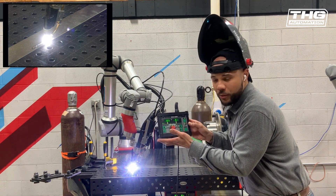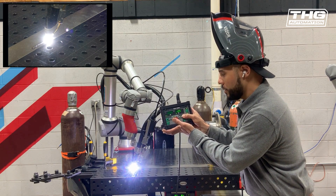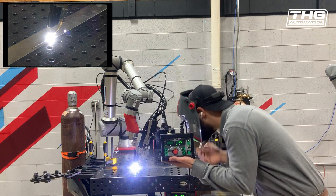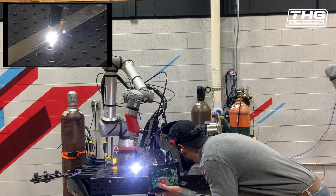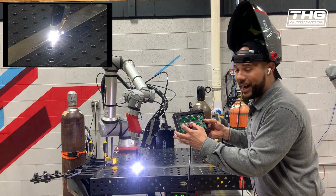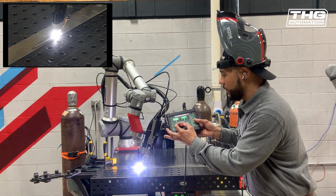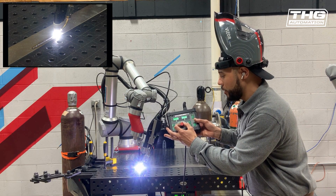I notice maybe the wire is a little too high. So we can go over here — now we've got our wire, and I'll bump it down to 15. Looks good. Now I notice it might be a little bit hotter since we took some new wire out. So I'll go back and chop it back down to the middle of the position.